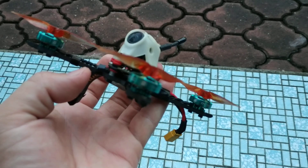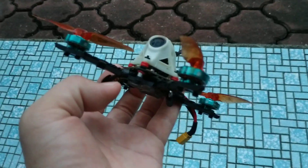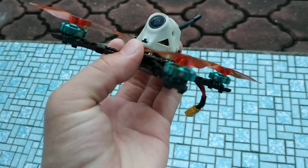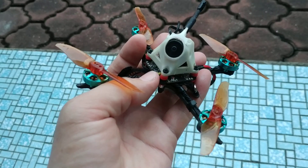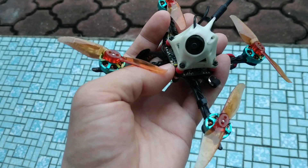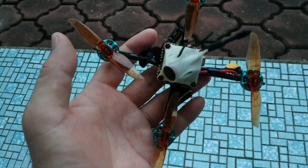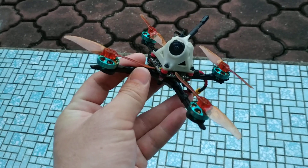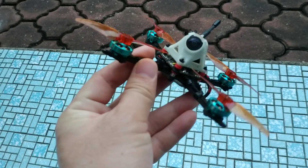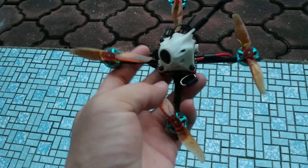I twist the wire and cut off a little bit from the end, then solder it from inside beneath the bolt rather than on top of the bolt, because it's cleaner that way. Also, I don't want to cut the wire very short even though it would be lighter, because from experience if you cut the wire short and then want to use it on other frames which may have longer runs, it won't reach. I want the flexibility of keeping longer cables for future use.